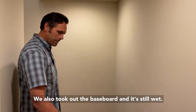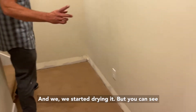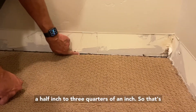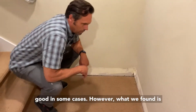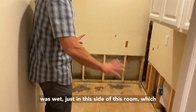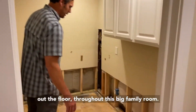It's still wet and we started drying it, but the good news is you can see the drywall was hung right — it's off the ground, probably a half inch to three quarters of an inch, which is good. What we found in the other room, which had cabinets and a wood floor, is it was wet just on one side of this room, which was really lucky, so we didn't have to take out the floor throughout the whole family room.